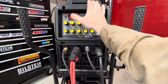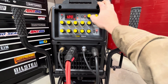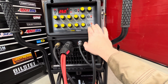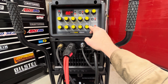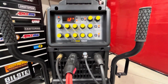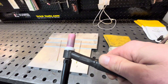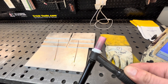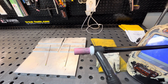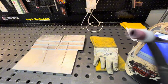Here's how I'm going to set the machine: 260 amps, AC frequency at 120 Hz, balance at 30%. No pulse, none of that. Post-flow I find 8 seconds keeps my tungsten nice. Pre-flow I like to run 1 to 1.2 seconds. Gas is set at about 18 CFH. I'm running a standard number six cup — a CK20 — which works really well for quarter inch material. For thinner material like 3/16 or 1/8 inch I'll drop to a number five cup for a slightly better cleaning zone.